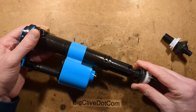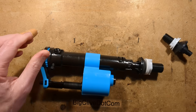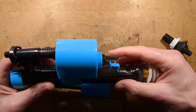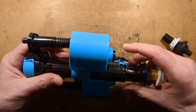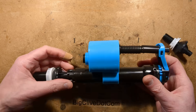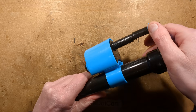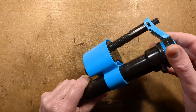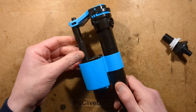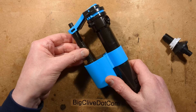It's got O-rings inside, and then it just turns to lock again. Another version — the brass inlet version — has a little locking pin as well that you have to pull out, move up to the height, and then push back in again. Up at the top we have the actual fill mechanism and the float. Interestingly, you can freely rotate this around the top of the body without affecting its operation. Even if it presses against the side of the toilet cistern, the float can still go up and down inside it.